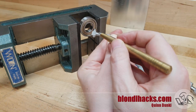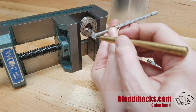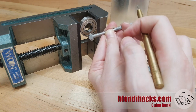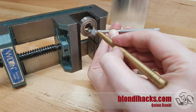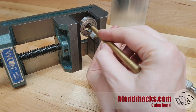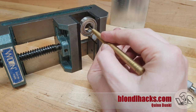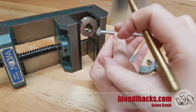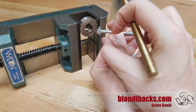Let's talk about what happened when we did that. When the anvils were in there at an angle, they were reading something larger than the actual bore — because they weren't square to the surfaces. As we tipped it forward, the anvils became more and more compressed because the distance was becoming shorter as we became aligned with the surfaces. The thumb screw tightens the anvils but still allows them to compress, and they stay wherever they were compressed to.